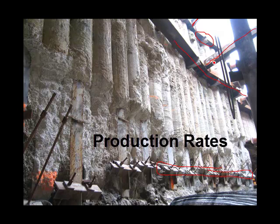The piles illustrated here are supported on rock — the rock is very high and the piles are actually perched on the rock. When you see a condition like this, the tip of the pile has to be anchored into the rock, and the cost and time consumed developing that anchorage detail are significant. So when I say you can accomplish one secant pile per day, that does not include any extra work such as anchoring or connecting the tip of the pile to bedrock.